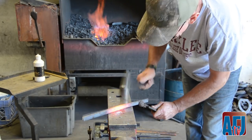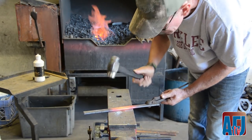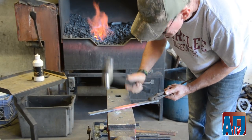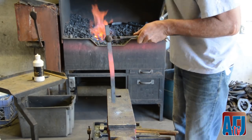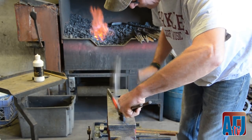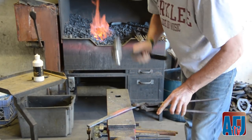Just add material. 5/16ths is just not enough in the toe to do anything forging, so you add material to the toe. Having a bump toe if you're going to make a handmade shoe is recycling - you're the original recycler. You're adding material so you can use it that many more times.